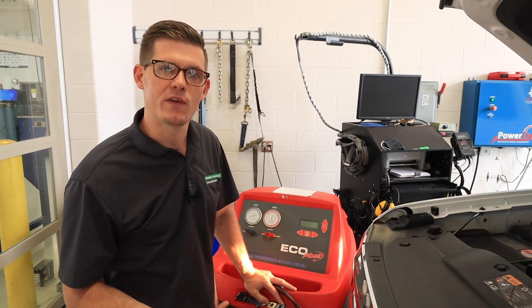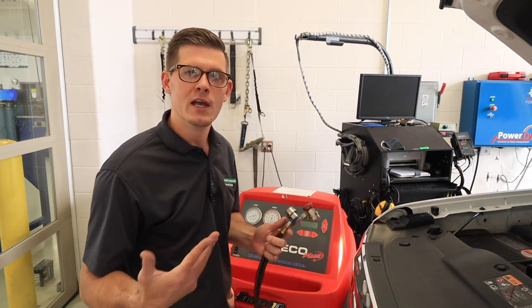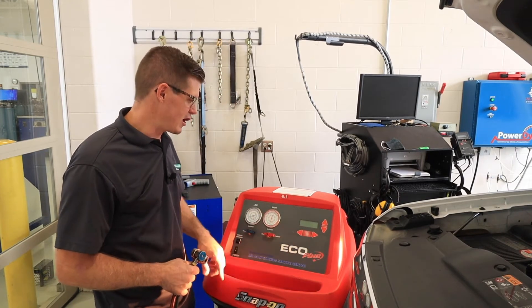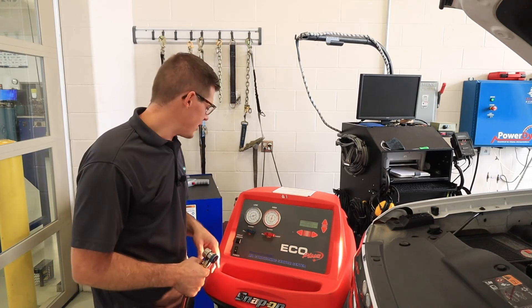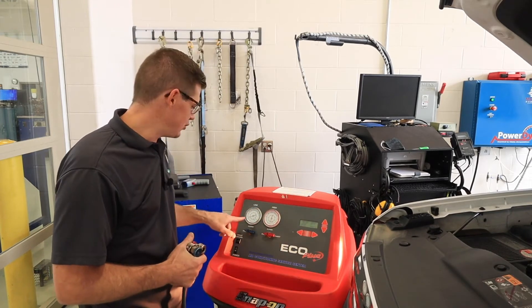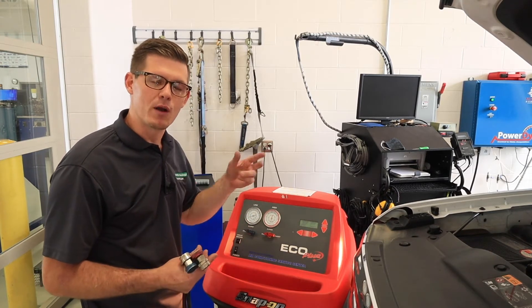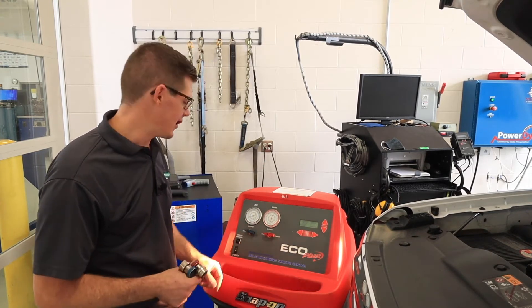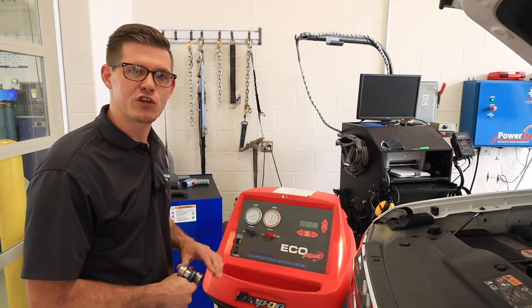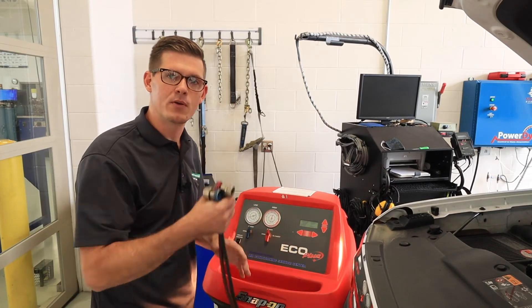Once we've selected our machine we've got to get set up. This machine has three cords: one plugs into the wall for electrical power, it has a switch and a small screen, so I can turn it on and make sure it powers up. The other thing I want to pay attention to before connecting my gauges is that the panel valves on the machine need to be closed. If I had a manifold gauge set I'd want to make sure those valves are closed as well. Some technicians leave these open when they're done, but it's good practice to always close them. So we're going to close them and then set up our connections.